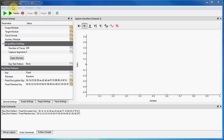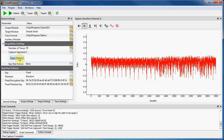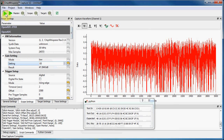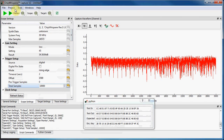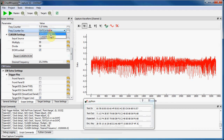This is the main capture window written in Python, and I'm running an example script to connect to an AES implementation in an AVR. I can then modify settings such as the gain on the low noise amplifier, the sample length on each trigger, along with trigger events, including the advanced detection of analog patterns.